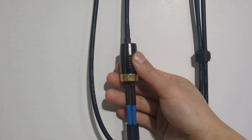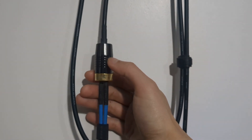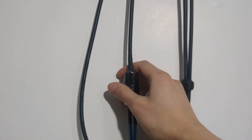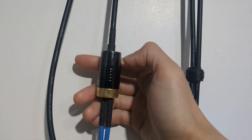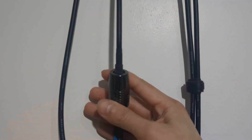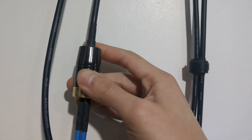There are smaller boots you can use for the Y-split on the cable, but I'm actually using something meant for speaker wire — very heavy duty, overkill, but I like the look. I think it's made out of copper or brass. So one for left, one for right — they converge here into a four-conductor cable. For balanced headphones, each cup gets its own ground.